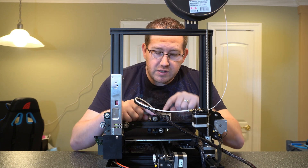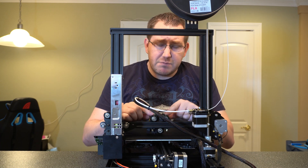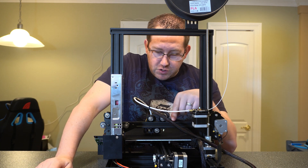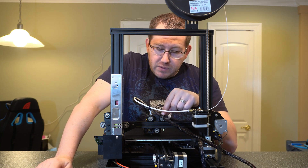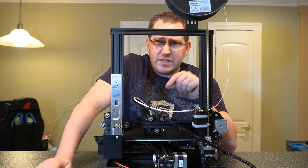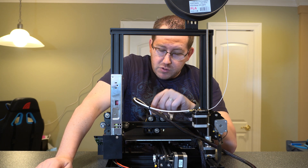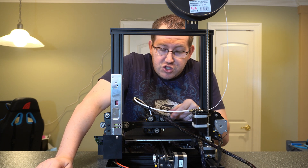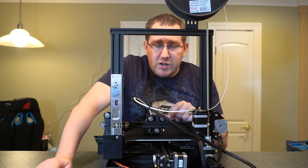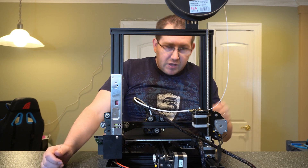The main reason I turned this around is to show you these wheels. You've got three wheels - two on top and one on the bottom. This keeps it in place and helps it move on the track. I did have an issue where I had a chip in one of these wheels on a different printer and it caused some weird lines on the actual print itself. After troubleshooting I ended up having to take most of the printer apart - it was a chip on the inside of the wheel. So if you're starting to see any type of weird movements on the print, look into the wheels first.